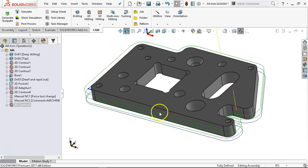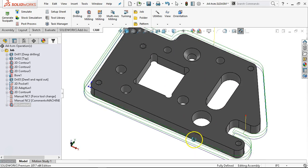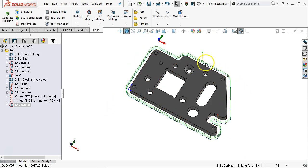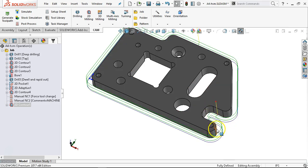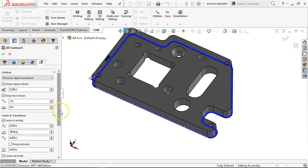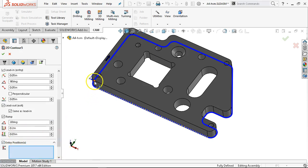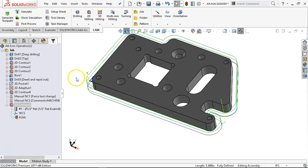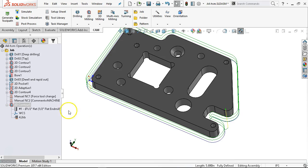If I was going to do a step and repeat, I would probably do this in a minimum of two steps. With the ramp I'm going to have consistent loading. It is kind of starting and finishing at some weird spots, so that would be one where I'd go back in and look at the entry position. Give me a slightly better entry position — it'll get as close as it can. My lead-out on the other side I'm less concerned about.